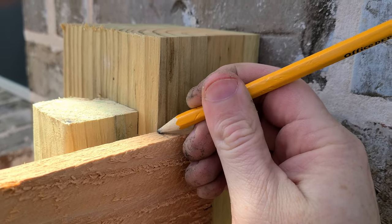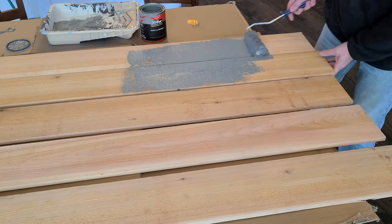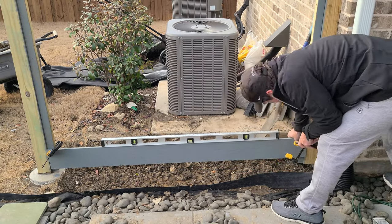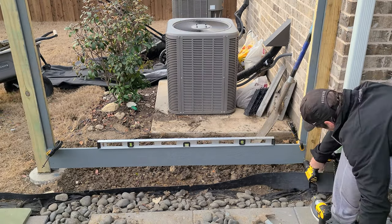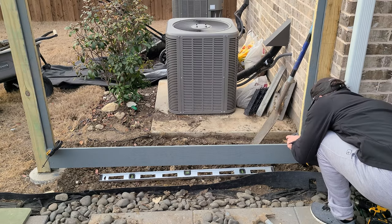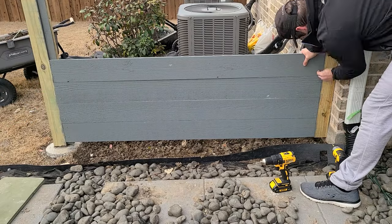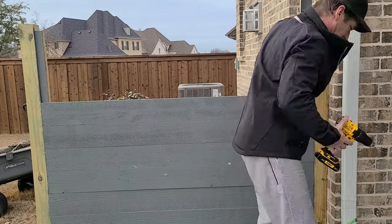The pickets are just a touch long, so I mark and cut those to length, then give them a coat of gray paint. I start with the bottom picket, get that clamped and level, then pre-drill and screw two holes on each side using one-and-a-quarter inch exterior screws. From there I'm just adding pickets one on top of the other — they went together very tightly. But you'll see they dried and shrank a little over time creating gaps, so depending on the look you're going for, you might want to give your wood some time to really dry.